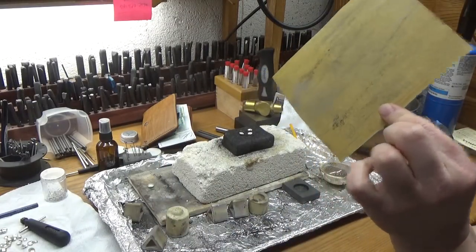Now, because the solder is on the inside — and this is where a lot of people get confused — anytime you're sweat soldering one piece to another, whether you're doing bead halves or just one chunk of silver on top of another, what you want to look for is to watch the edges. Be very careful — this is 24 gauge, so be careful not to melt anything. Maintain your heat control; don't forget to back your torch away when you see the metal is almost getting to temp. How do you know your solder has flowed? You're going to see a flash of silver going across the edge, right where the seam is. That's really cool to watch.